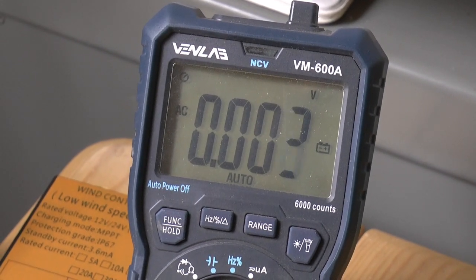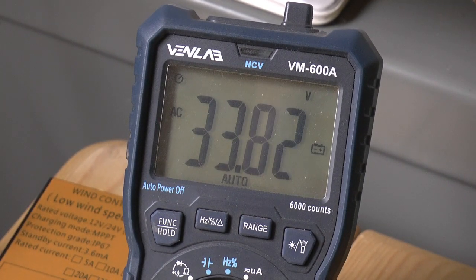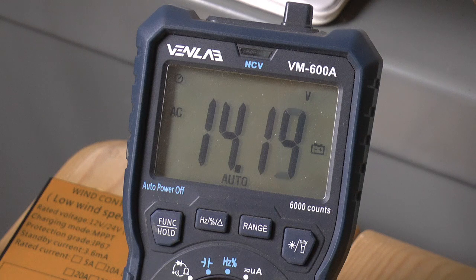Turn you back on if we get some wind. Okay, getting some wind now. We're making about 1/4 of an amp. That's the one phase of the 3-phase AC coming in voltage that you're seeing. As you can see, you got to have a lot of wind to do anything useful with it at a 48 volt system.